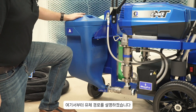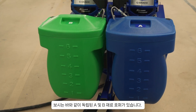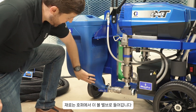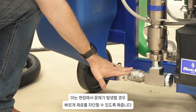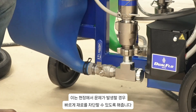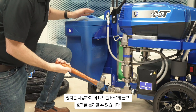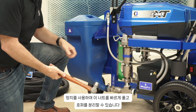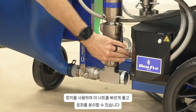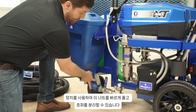Let's start with the fluid path here. As you can see, we have two independent A and B material hoppers. Material comes through from the hopper into this ball valve here, which is for quick shutoff. So in case you have any sort of issues in the field, you can quickly shut this material off — take a simple hammer or a crescent wrench or any other hard object — and quickly take this nut off and loosen this hopper up.